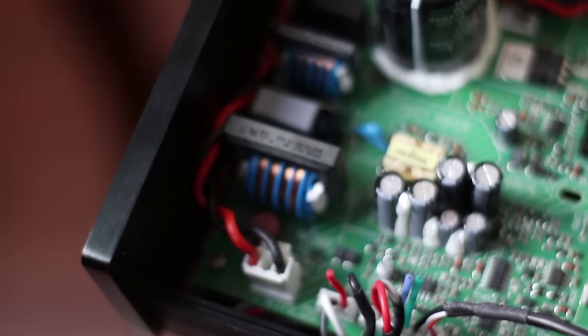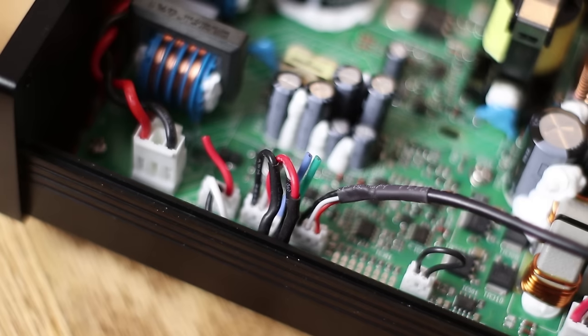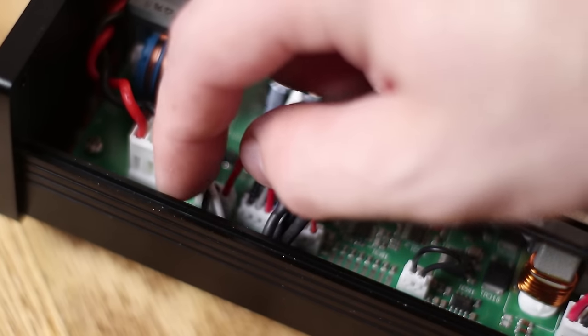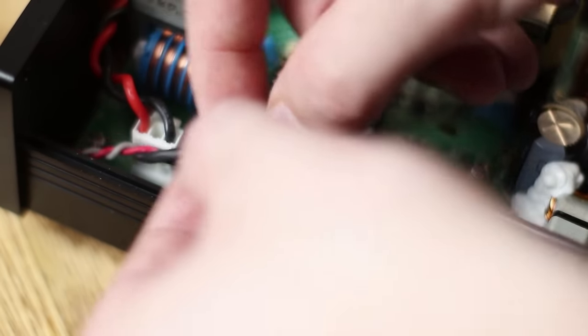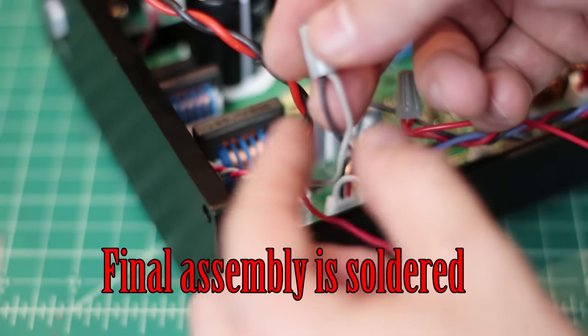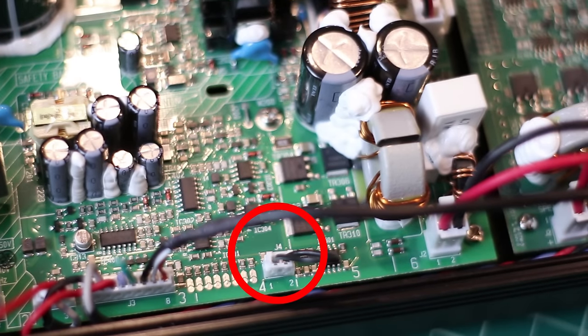The one other thing to hook up to the power switch is the LED light. Plug up the red and gray wire — red is positive, gray is negative. Run that to the jumper connectors right next to P1; there's a three-wire JST terminal there. We're only using two of those wires — cut off the far right red wire and use the white and black. Hook the white wire to the red wire, and the gray from the power switch to the black ground. Then connect a jumper cable between bay four and five on the ASP board, and your LED is hooked up.